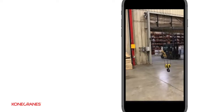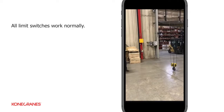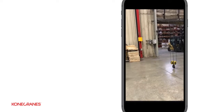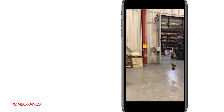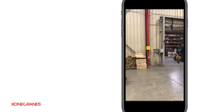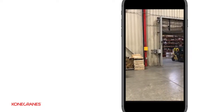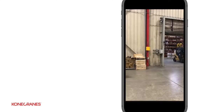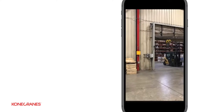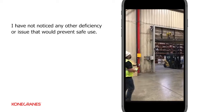He's going to check to see if there's a lower limit. Note that he is farther away — the lower limit engaged, so it is working properly. Note that he is away from the crane; he is not under the hook block doing his visual. All along as he's moving the crane, he's still doing visual checks.